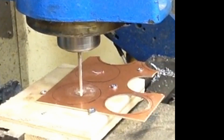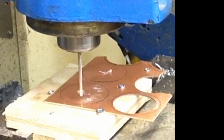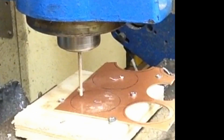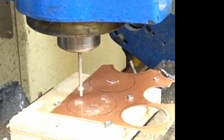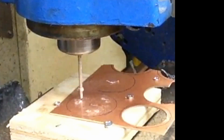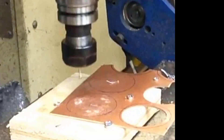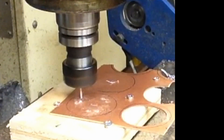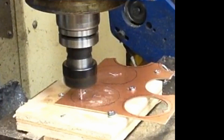All I'm doing here is drilling out the holes for the six ball bearings that go on there that support the probe. The setup is I just took a piece of scrap wood and a piece of three-quarter inch plywood, screwed them together, set it up in the vise, and I took a fly cutter to level off the top of that piece of plywood and just screwed this piece of circuit board down. Quick and dirty setup — if I'm just doing a one-off, or in this case I cut three more of these printed circuit boards, I'm probably never going to do this again, and if I do I'll set up the same setup. There's no sense in doing any specialized fixturing.